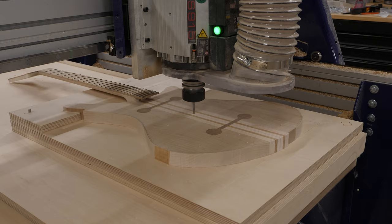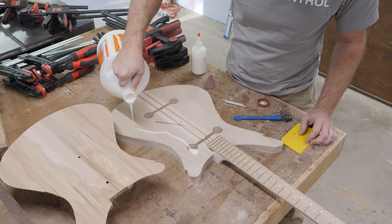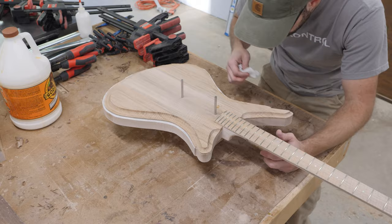In this operation, I'm drilling some locating holes and I also cut a groove for the wires from the pickups. My go-to method for gluing up larger areas is to just pour directly from the bottle and use a squeegee to spread out the glue quickly. Those locating holes allow me to use some dowels to align the top and the body, so I can focus on getting things assembled as quickly as possible and cleaning up any glue squeeze out before it becomes a problem.